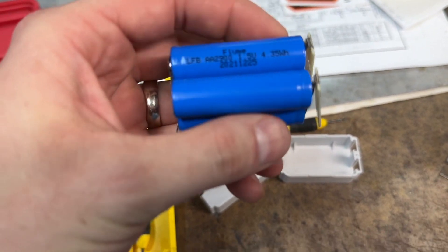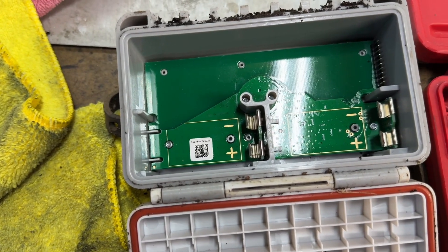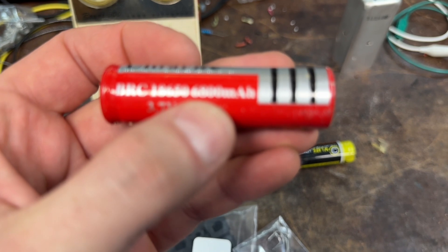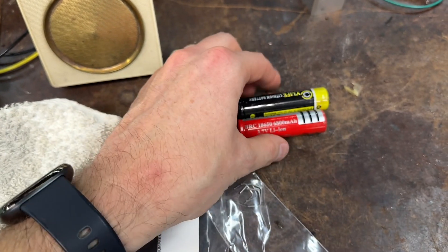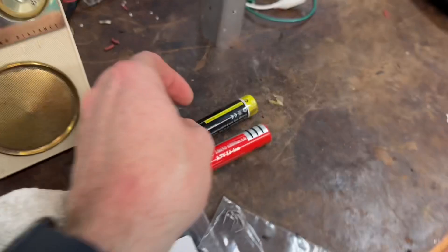It needs to be a 3-volt system - that's it. So we've got 3 volts and 3 volts, and we could put anything we want in here. We could put an 18650 or one of those big giant cells. This one is 6,800 milliamp hours - so 6.8 amp hours. That's pretty high energy density. They rated the originals at 4.35 watt hours divided by 1.5V. I can get way more energy density in there just by putting a couple of 18650s in there.